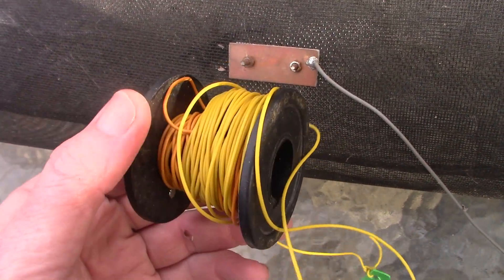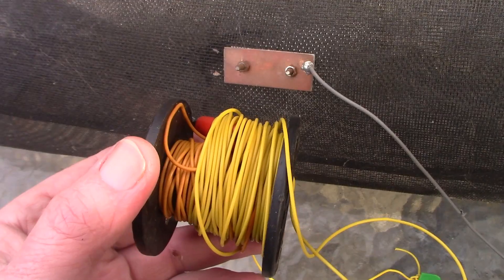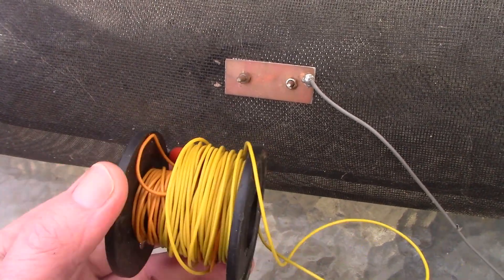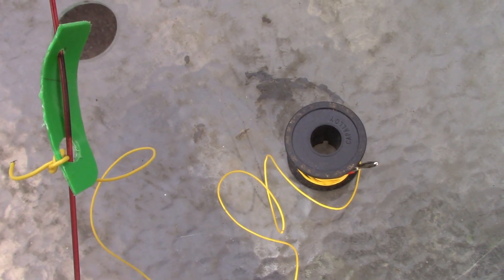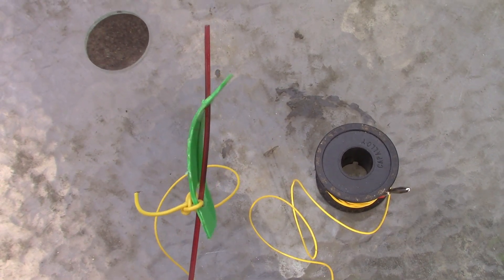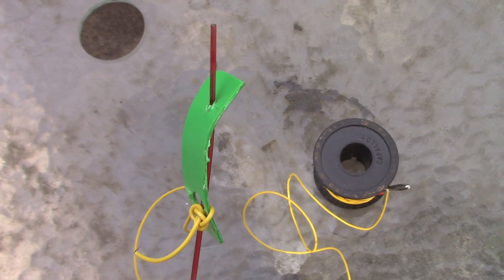As far as the length, this is five meters of wire, which makes it a half wavelength on 28 megahertz, a quarter wavelength on 14 megahertz, and with an L-match antenna coupler it should work on all bands in between — maybe even a bit lower. I've used a piece of flexible plastic, possibly from a margarine container lid, which allows the antenna wire to be mounted to the top of the telescoping pole.